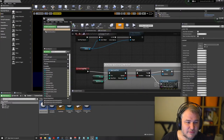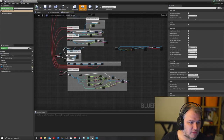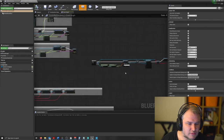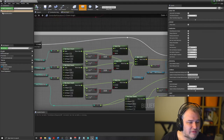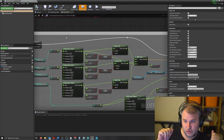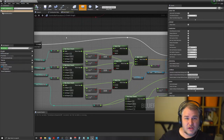We've also done the same for the controller. So let's have a look at the controller. This is very similar to what we had before, but there are a few changes in here as well, and we've got some stuff that is more test related. We've done some more clamping of values, so we've tried to control the range now instead of it being up to a 0 to 1024 in terms of the value from the controls and the joysticks. We've now increased that to 4096, and we've tried to clamp the ranges back to get a little bit more control.